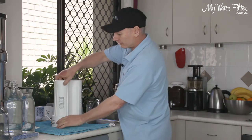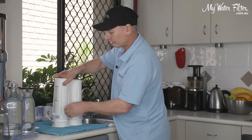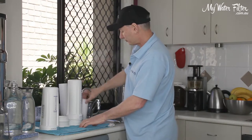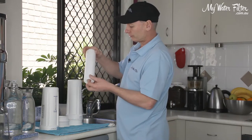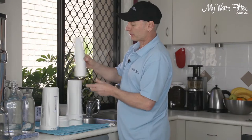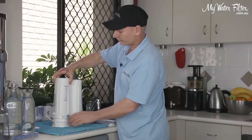So once we've done the loose, they'll now unspin very easily. We'll start simply here with the cartridge in housing number one — this is our pre-filter, our sediment cartridge. Take that one out, lay it in the sink. Here's our nice new one. Put him into place — the center core's at both ends, there's no up and down on a polyspun sediment cartridge, they can go in any way, and they just sit inside the housing. Then the housing will go down over the top.